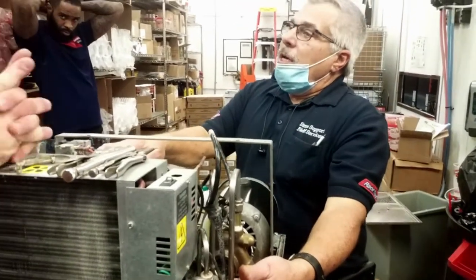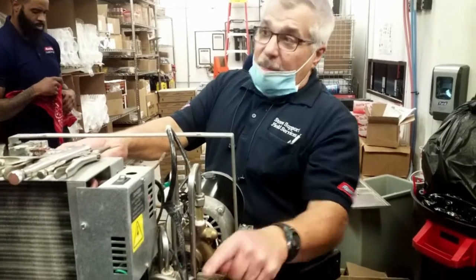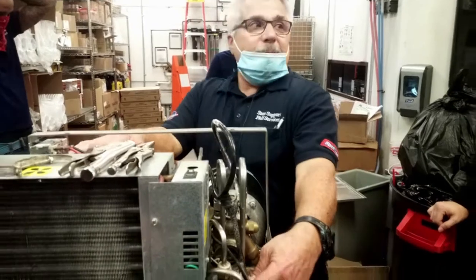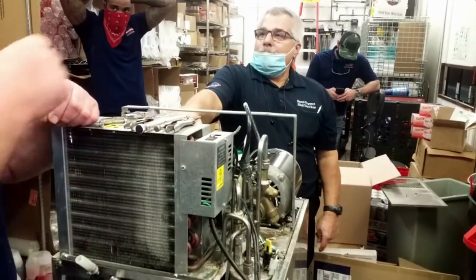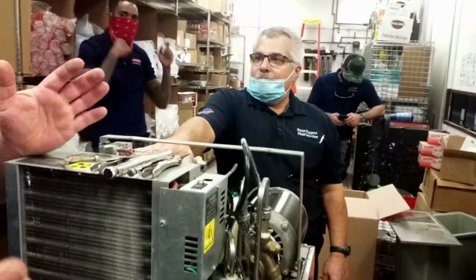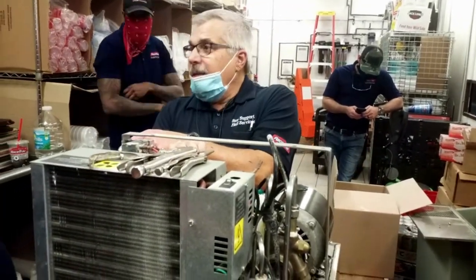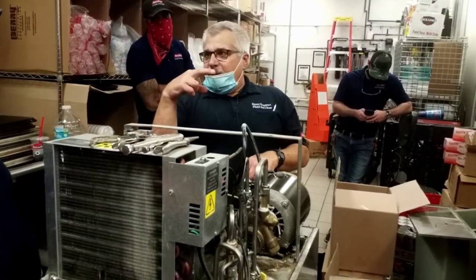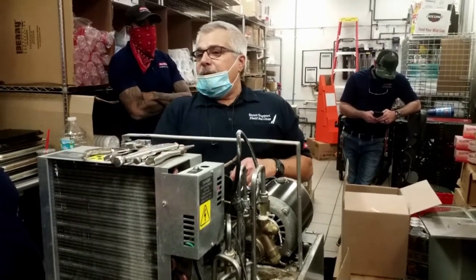The fan I had was a filter water. It was just the water with a carbonated taste. That's why that's a double check valve, so that doesn't happen. But they're saying, hey, the water tastes carbonated on the filter water. You've got a carbonated water and a filter water. Well, the only other thing that could cause that is the block on the fountain that has the water and the carbonate has a split, and one's bleeding over into the other.